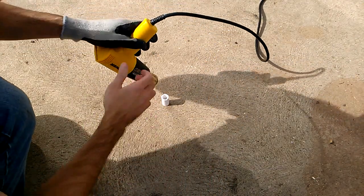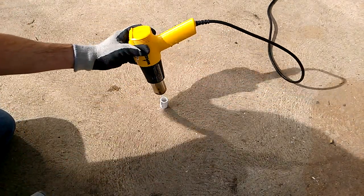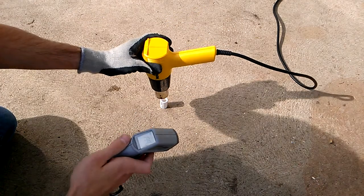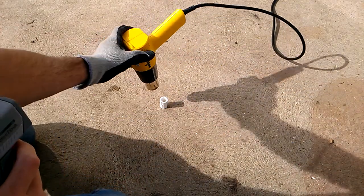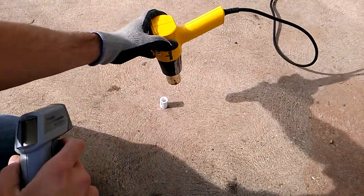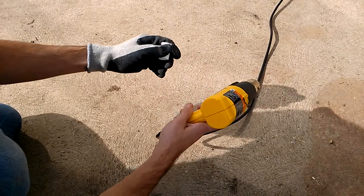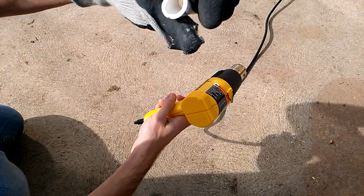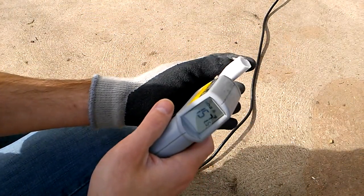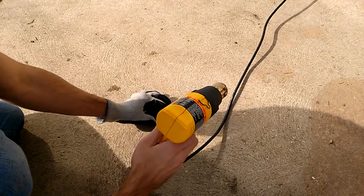185. 199. Now, the other thing is, this is only the surface temperature — it's not telling us the core temperature of the PVC; it's not that same temperature throughout. That's one problem using the infrared gun. It's reading 220 right here, and now you can just deform it. It's not 220 throughout — if I check it, it's 153 there, 157 there, 160 there. On the inside surface it's 170, so you get an idea of what temperature it's at.